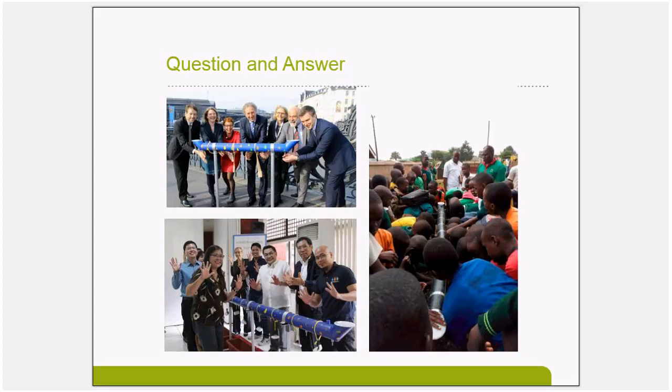For example, this inlet where you can fill in the water manually. It's important not to have what you see on the pictures here, which is a white inlet. They were suggesting to change the color and make it black, so as to really reduce the amount of UV light entering the system.